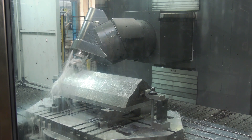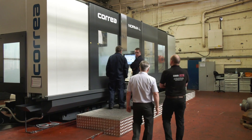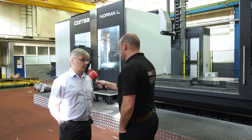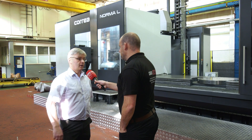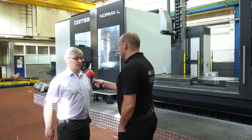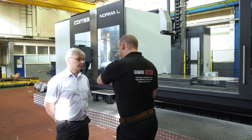The proof really is in the visuals here. I also want to touch on the pendulum machining aspect, because with this size of Norma — about seven meters of axis stroke — you can put your division in the middle and set up the second side exactly. The pendulum system means that on this particular component, we machine the bases on one fixture and then move them across to the profile machining operation every second cycle. In effect, it's acting like a twin pallet machine tool, but you've also got the added bonus that you can remove the pendulum setup and use the full length for long shaft work.